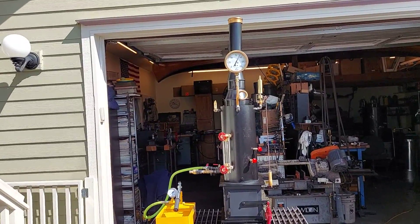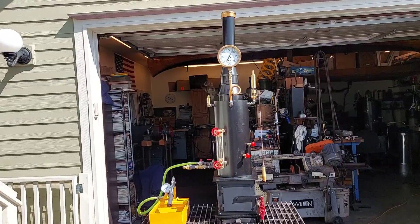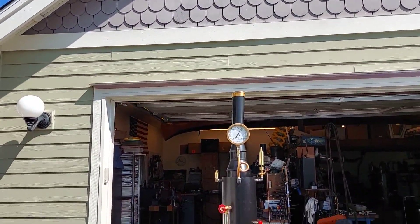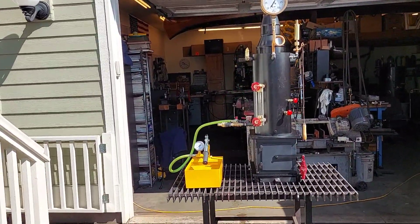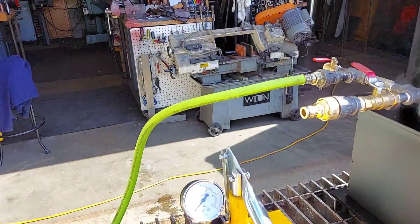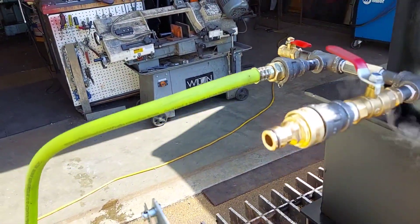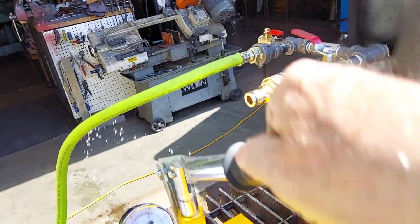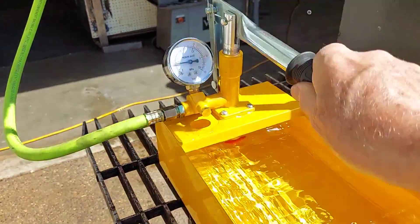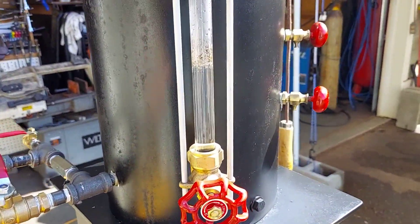About one and a half bore, two inch, maybe two and a half inch stroke. Anything smaller than that is fine, and anything a little bit bigger than that would work as well. This is your airlock valve right here. Open that up if you've got air in the pump. Once you've got water coming out of it, just close that off and everything you pump now goes right into the boiler. Always watch it on the sight glass going up.